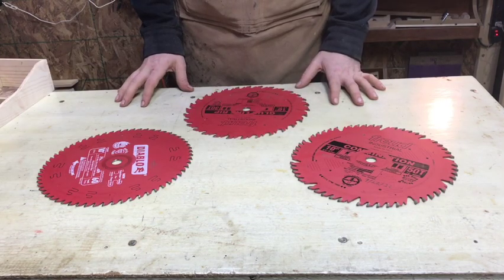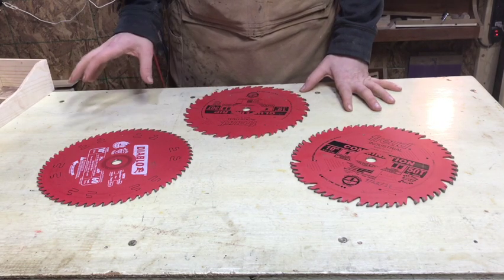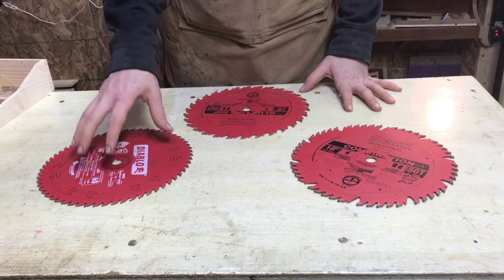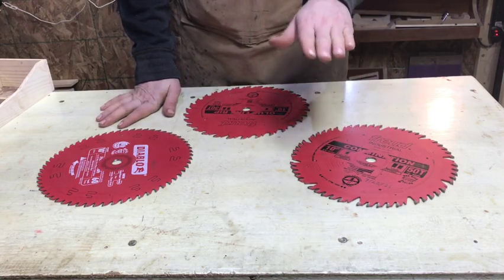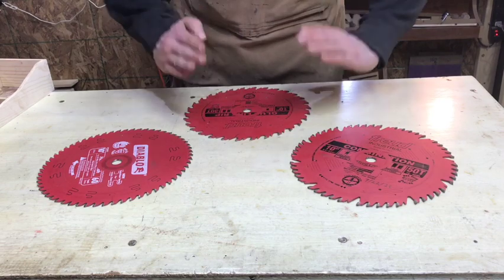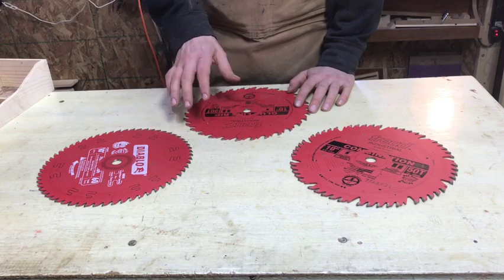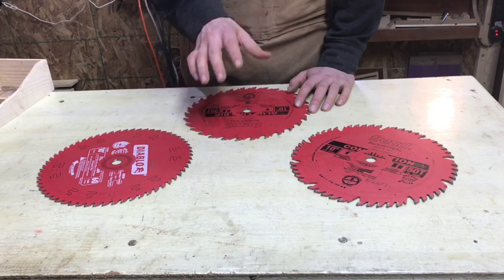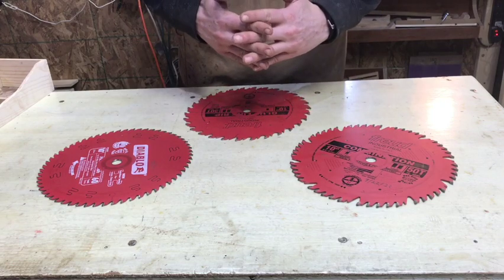There are a lot of different types of table saw blades, and the type you choose for your finger joint will determine the look. We have the alternating tooth bevel — the ATB — which is very common. We have the combination blade which has alternating tooth bevel teeth and a raker, which is a flat tooth grind. Then there are blades like this glue line rip blade with a triple chip grind — an angle and a flat top every few teeth. And then there are blades that are pure flat top grind. Some ripping blades have that.